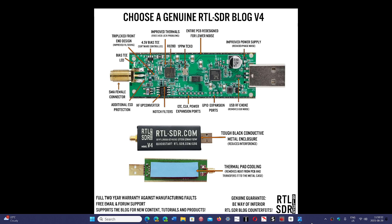It is plug and play for the SDR Play because you just install the software — it installs the drivers and everything you need, you plug the device and it works. With the RTL SDR V4, it's not just installing the software. You have to tweak a driver, take a file and move it somewhere else. That's not plug and play. Understand what plug and play means: you don't have to play with files. You just click, install, and it works at the end.